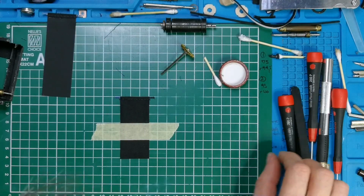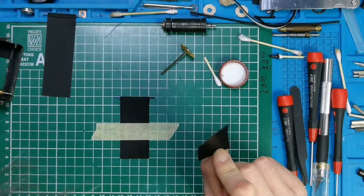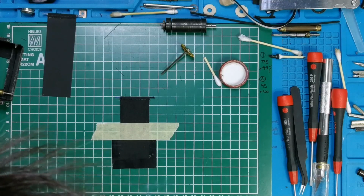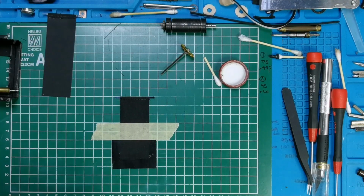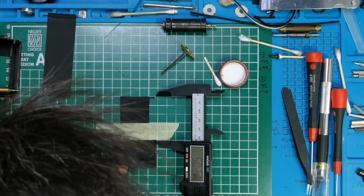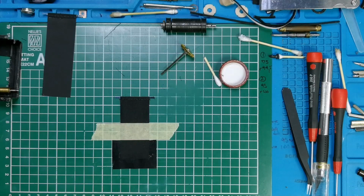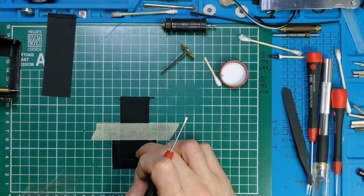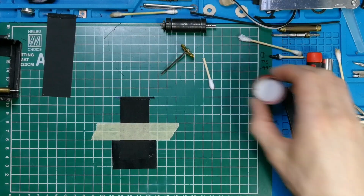Anyhow, to apply the glue on the roller, on the curtain and not on the mat, I use a piece of Teflon tape used in cooking, so you put it in the tray. I put this under, and I will use glue for like, let me check again. Yeah, so 50 is about here, and I will go with the glue right about here. It should be enough because there is no force on this curtain big enough that could rip it open or rip it apart.